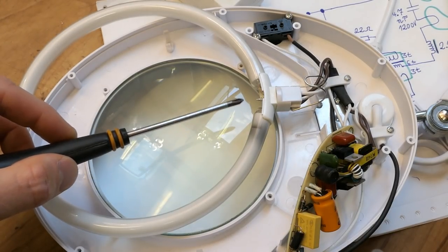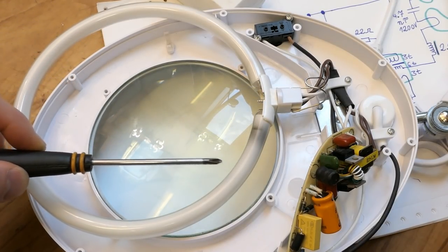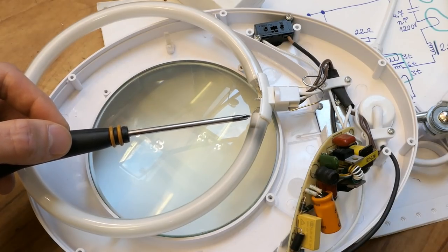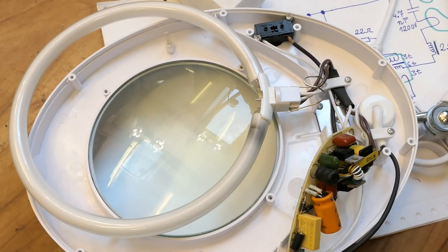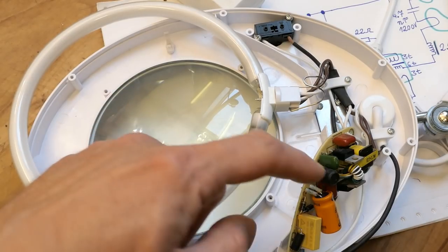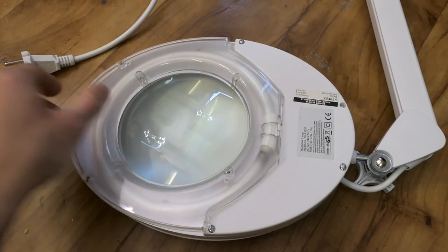On the surface of the heater there is an emissive layer, which makes it easy for the electrons to go from the metal into the mercury vapor. But now the emissive layer is exhausted and there is basically just some bare metal, and it's very hard for the electrons to go from the metal into the gas, and so the electrode drops much more voltage and much more energy is lost when the electrons go from the metal into the gas, and it dissipates a lot of power, and that's why the electrode is getting so hot, and this is not a proper operation. It's not a proper fix, and also the light coming from it is not steady, it flickers. And if I was running it like this for longer, it would probably destroy the transistors or other components in the inverter. So that's it. It just needs a new tube.